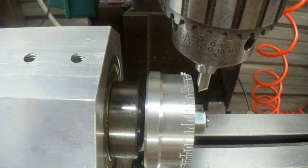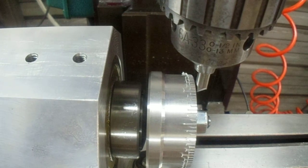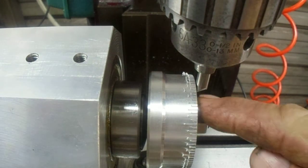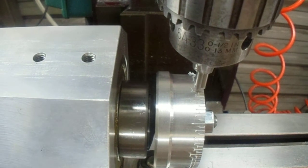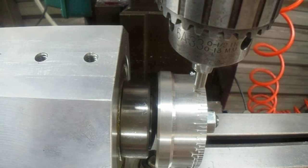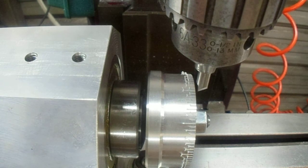The major marks are where the numbers will be stamped, and the major mark is a quarter of an inch long. I have the digital readout set for zero at the face of the dial and the beginning of the engraving tool, so we'll move in here — two-fifty, two forty-eight, that's close enough — and back off. We're using a twenty-hole plate and the machinist handbook tells me that to get a hundred divisions on the circumference of this dial, it's eight-twentieths of a hole.